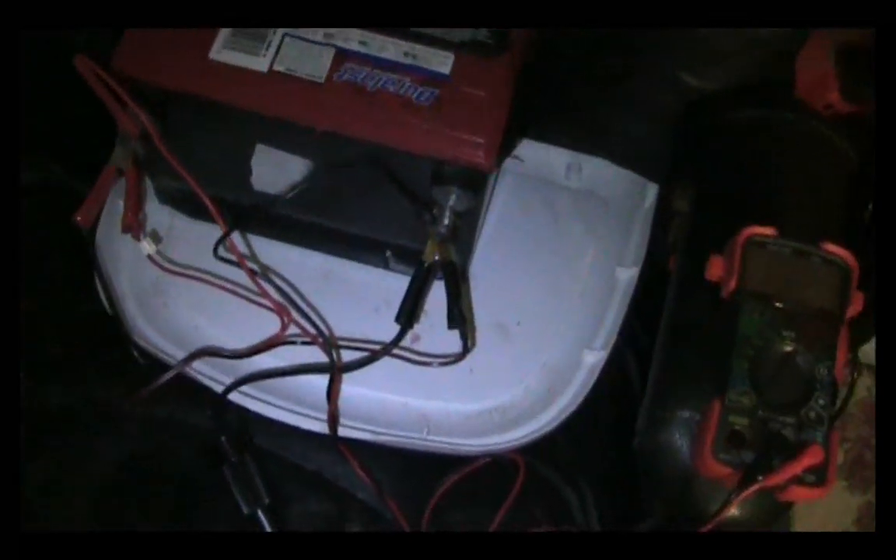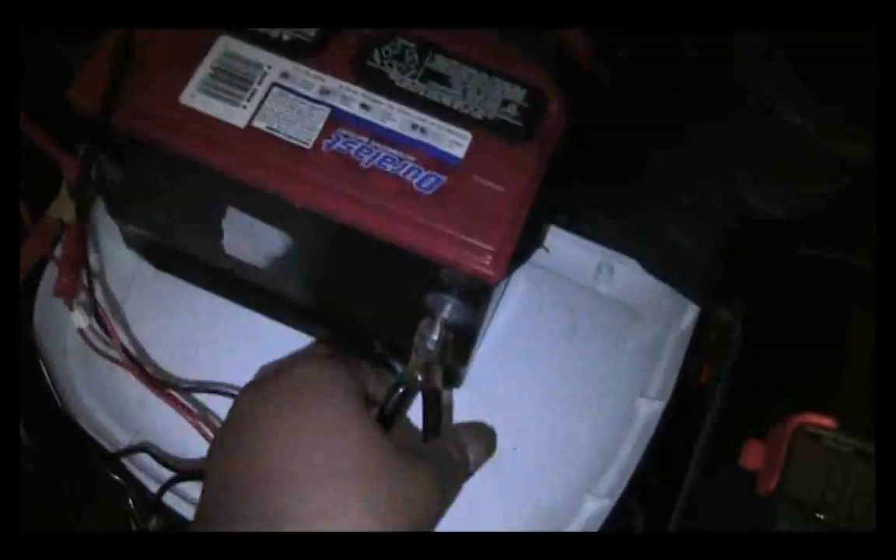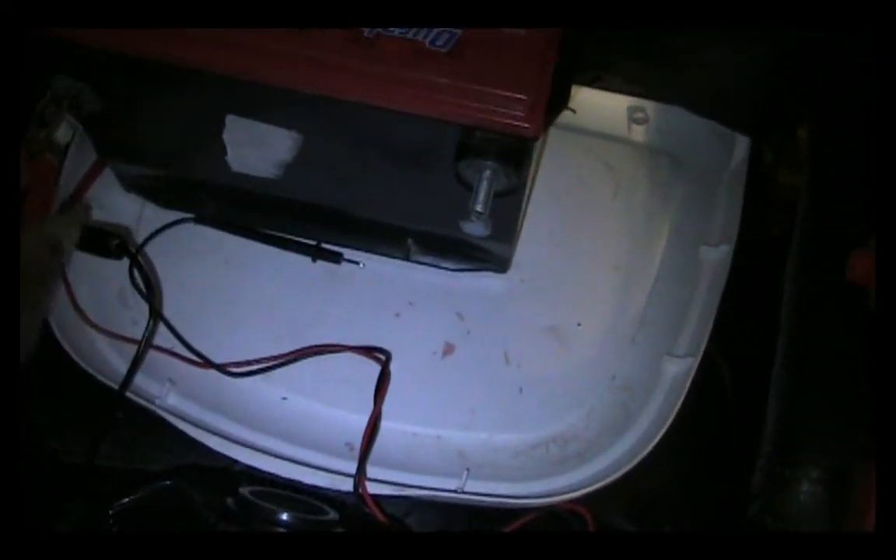I'll show you how strong the panel is. The fan draws 10 watts — roughly half of what my panel produces. I'm going to disconnect the charge controller from the battery and have the fan run on solar alone. Watch — the negative comes off, the fan actually speeds up; the positive comes off, it's still going. The charge controller is on and the wires are just coming from solar, with the battery disconnected, and it's working fine.